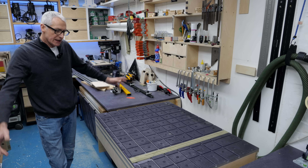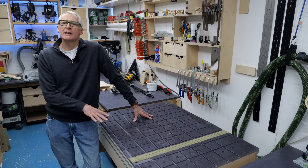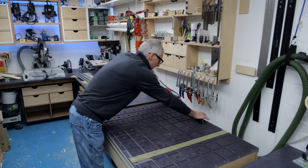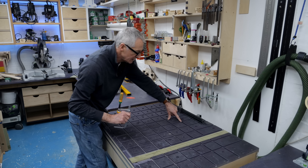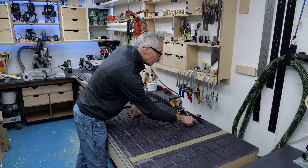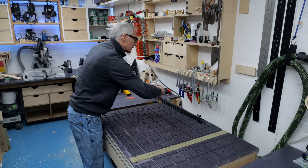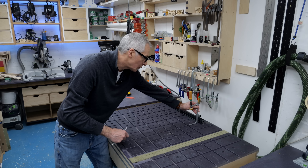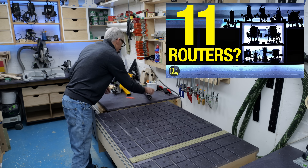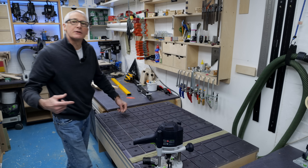So what's to be done? Well, no, I'm going to give it a few more months. This top is going to be replaced before too long. What I'm going to do to make life a little easier is just route out these grooves far enough back so that I can clamp in from this end — I'll probably take it all the way back with a white pencil line marked out. That should resolve the awkward issue of not being able to get a clamp in from that side. I've got a slightly different router to use and I'm going to open these up with a half-inch (12.7mm) bit using a couple of one-millimetre packers between the straight edge and the bench dogs to get the bits centred, opening up the back section of the dovetail groove in a single pass, then rinse and repeat all along the width of the bench top.